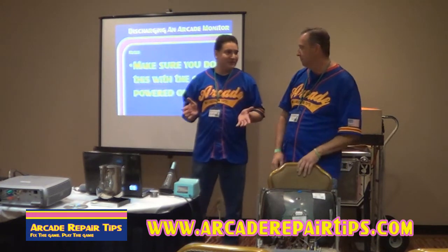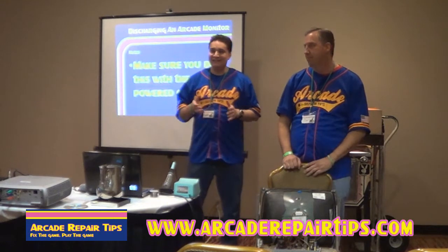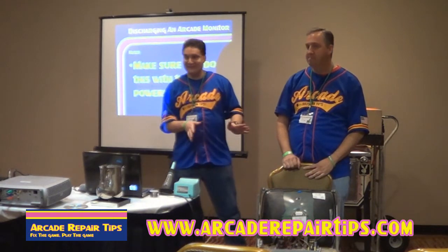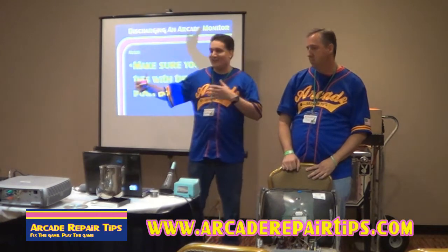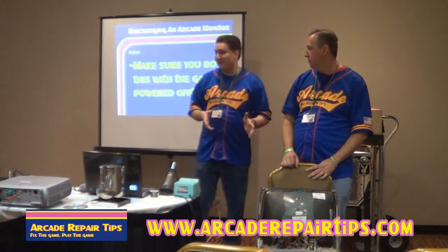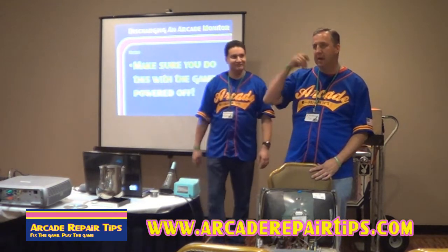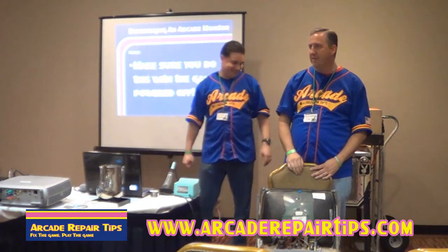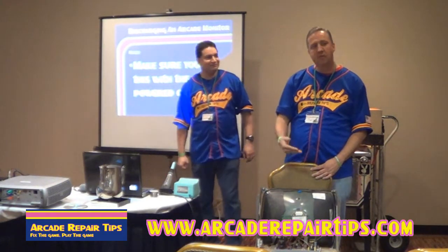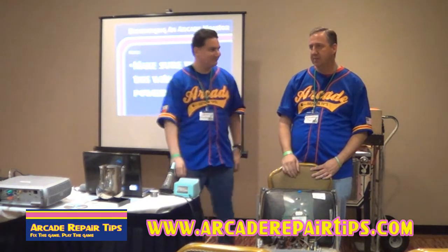I don't know how many questions, Tim, we've gotten from people who are so scared to do this part right here. They're like, if I just let it sit there for a couple of days, will it just discharge on its own? Will I be okay? Guys, we're always going to err on the side of caution and make sure that we discharge the monitor as much as possible. How many of you were the kids that licked the battery to see if it was good? That's worse than that. Come on now, it's not really that bad. Overcome your fear, and you don't want to pay somebody to come out and have to do this.